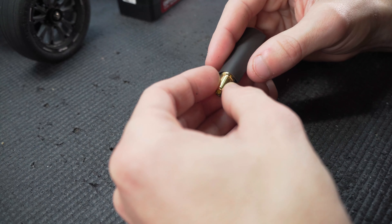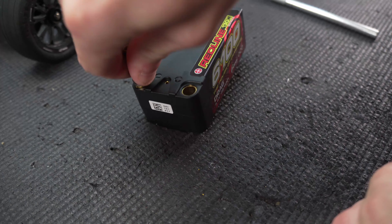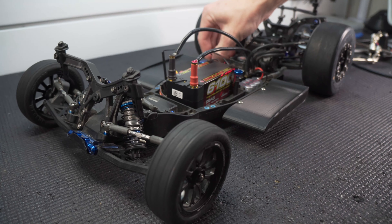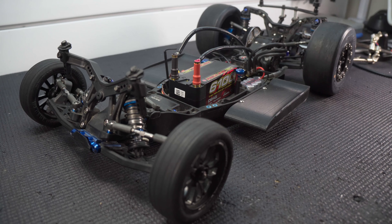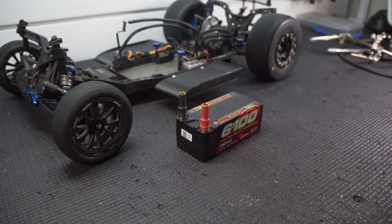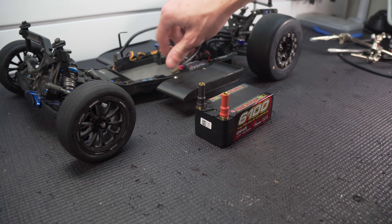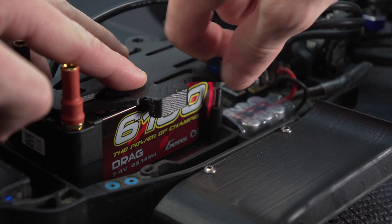You should be able to see now we've got a good bit of solder inside of that bullet connector. Only a few more steps. Next up we're just going to trim our wire back a little bit — about right here. You don't want too much wire. We want this to sink in pretty far, maybe even a little more. We're going to strip the casing off this wire as well, then pre-tin this end of the wire. And lastly, we want to solder this into our eight millimeter connector. We need a good bit of heat here so this may take a moment to get that solder warmed up and let that connector fall into the other connector. And just to make this as clean as possible, we'll add a little heat shrink tube, which will also help us differentiate between the negative post and the positive post.